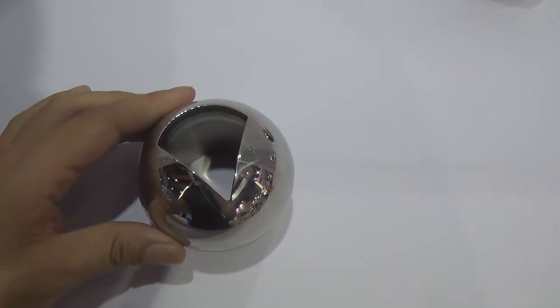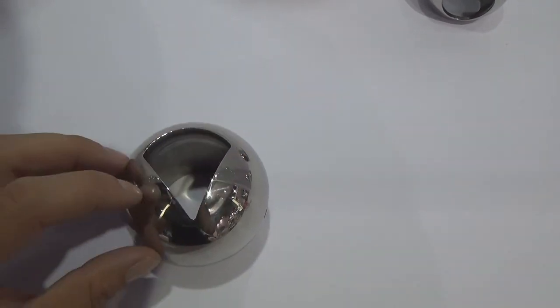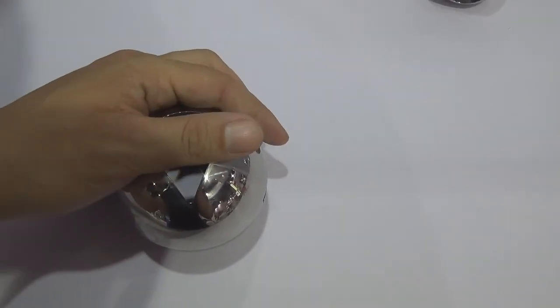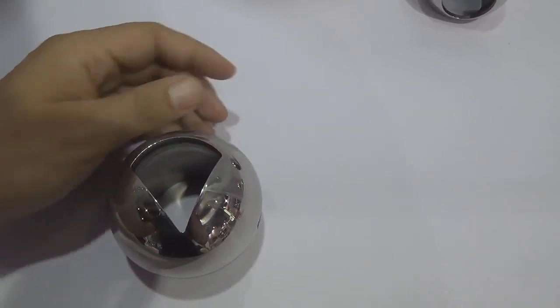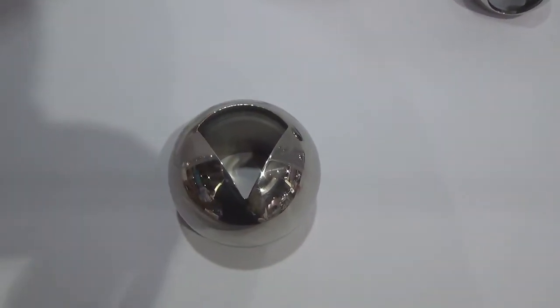This is a V-ball - it is one kind of control valve ball. The reason why we produce a V on this valve is because the V is going to control the valve CV. When we are going to open the valve a little bit, it is going to have a small CV for this ball valve. When we open more, the valve will have very high CV. So this kind of ball valve we are going to control the valve CV, especially in control valve applications.